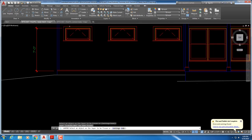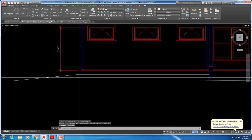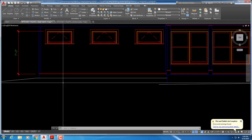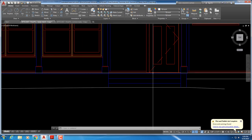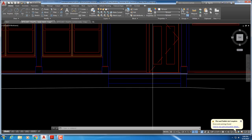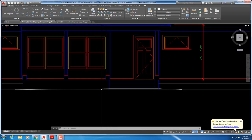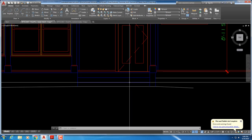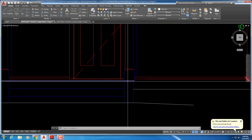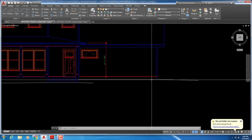This is approximately eight inches below and it's straight across at this point, then it angles down. We don't need jagged edges because when they grade up to the house it will be relatively smooth. Over here, six inches each for the step — the first one is an inch and a half below on the porch, so an inch and a half below finished floor and the door, then six inches, six inches, and that should be six inches too. I angled it slightly going in each direction, and you do have the concrete porch behind the steps. The edge of the line should line up with the edge of the column, then it's about eight inches down, straight across, and out a bit for the ground line.